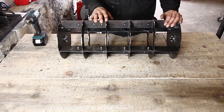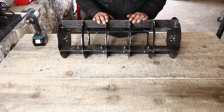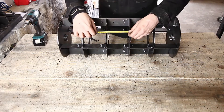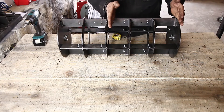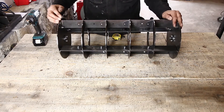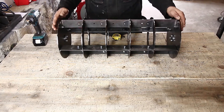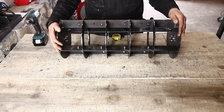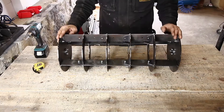What's variable about this grid marker are the inner plates that can be arranged in patterns that market gardeners commonly use. Right now it's arranged at 12-centimeter spacing — 12, 12, etc. We can arrange it at 15, 20, or 30 centimeters; those are the most commonly used combinations. For 30-centimeter spacing, my plan is to build the same thing but with only three horizontal bars spaced 30cm apart. So in the future we're going to have two types of variable grid markers.